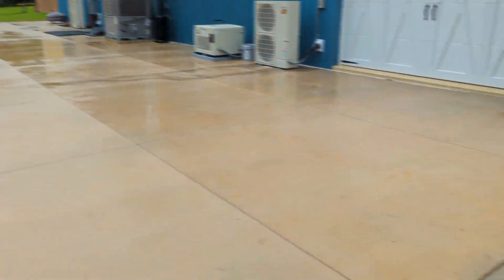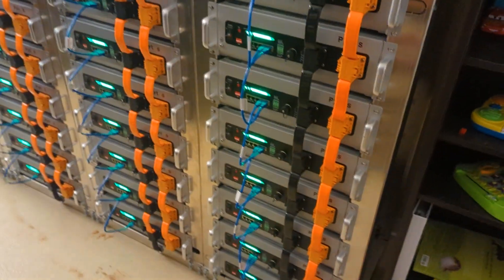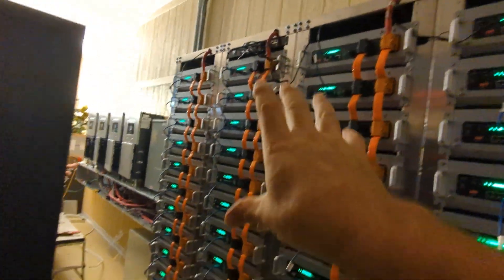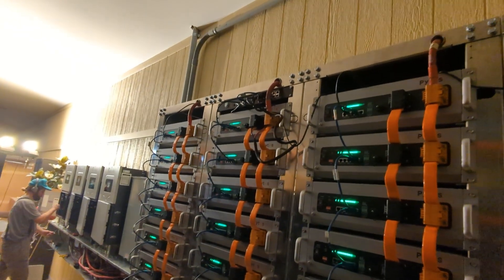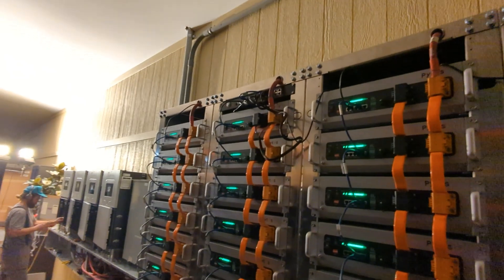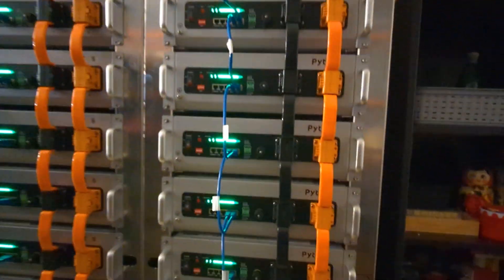Inside, we added another stack of the 14 v5 Pylontech batteries. They're all connected to a hub — you can actually do four or six groups of 16 with a single hub on the v5 Pylontech. It's a 1U unit, basically a CAN bus router over to the inverters. We got everything charged and balanced out yesterday.